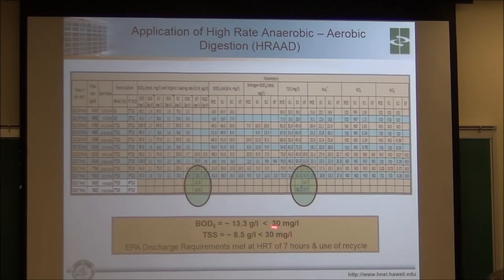Their simple designs are pretty darn effective, and in 7 hours that's a pretty good hydraulic retention time. It's not nearly as fast as you can get with sludge systems, but you don't have to do any aeration except with just a basic small fan.